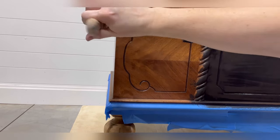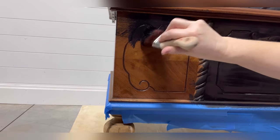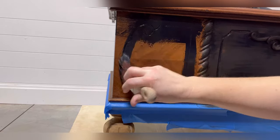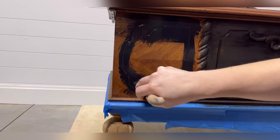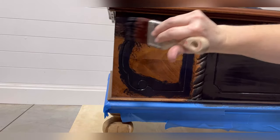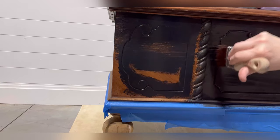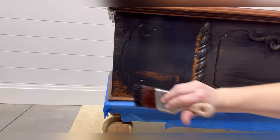Creating a washed paint look really looks great on these old antique pieces. What that means is you're going to do a light brushing of paint over top of the existing wood finish, which will give you a peekaboo effect so you can see the wood finish showing through underneath your paint. It gives it the look of old worn paint. You want to put a smaller amount of paint on your brush than you would for full coverage, and apply it with a light hand so you're not putting the paint on too heavily, while still leaving some of that original wood finish peeking through.